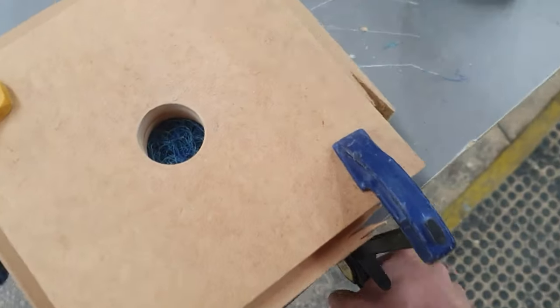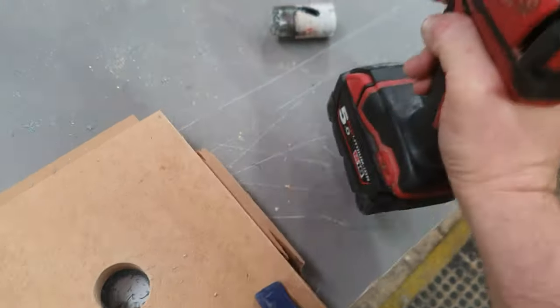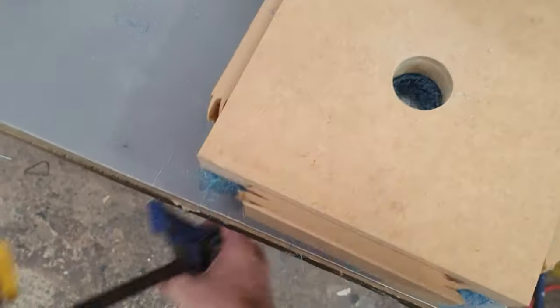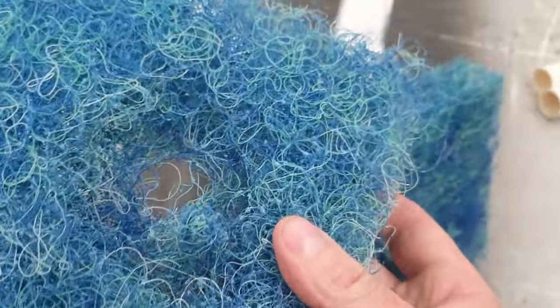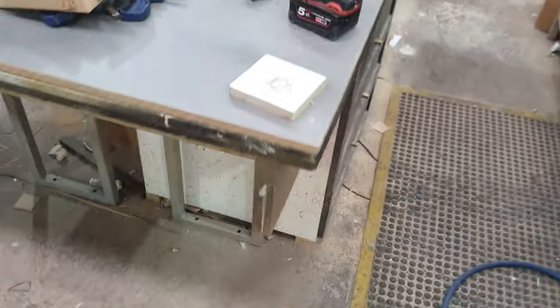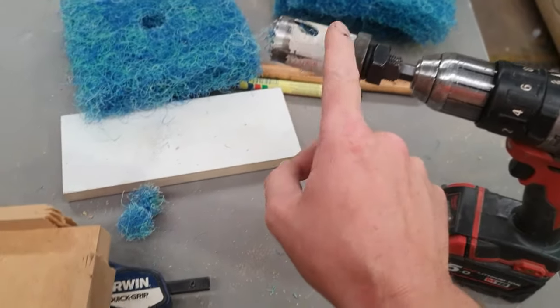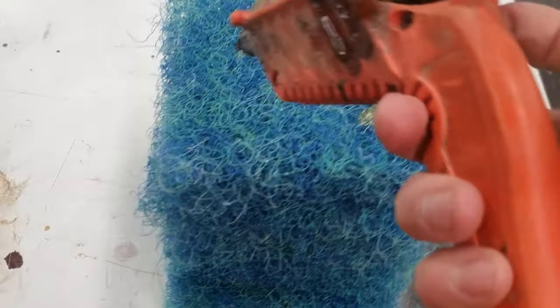We clamp this as tight as we can, and here's the trick - I've taken the drill bit out of the center because the drill bit just makes a mess. We're going completely backwards - that way it doesn't rip it, it's more burning or melting it, but the hole is perfect. I'll show you one forwards so you can see - this one has actually ripped the whole center out, that's what happens if you go forwards. I even messed around with using a smaller hole saw. This one is the exact size that I need and it's working.